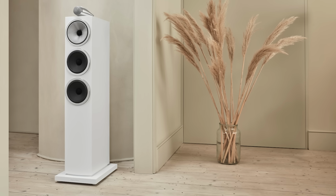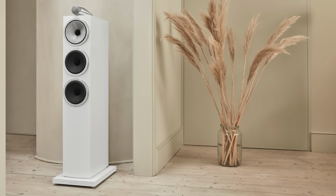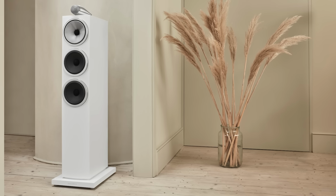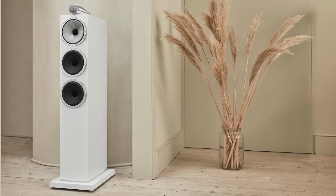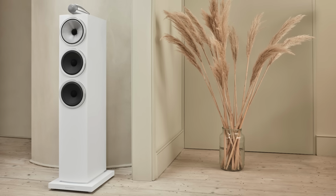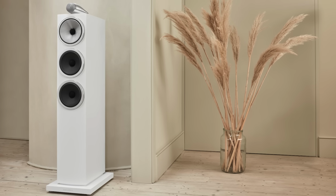They were kind enough to let me use my single-ended solid-state amps in one of their large listening rooms for extended auditioning. In comparison to 2 speaker models from other manufacturers, they had a flaw. They did not reproduce vocals realistically. Though they had other wonderful strengths which I liked, there was a visible, in measurements too, 6 dB dip at about 2 kilohertz, and another at 5 to 6 kilohertz depending on listening axis, which I could not overlook.